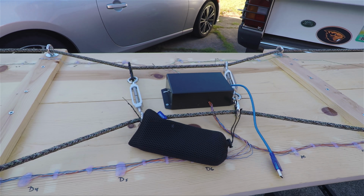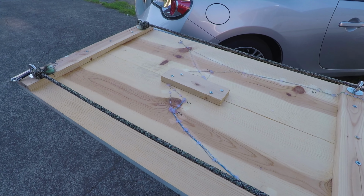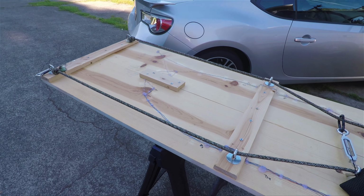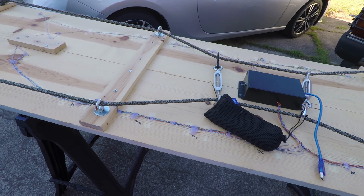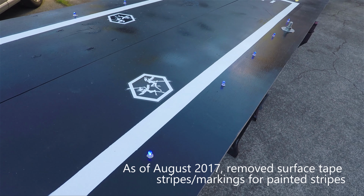The LEDs are all tied to an Arduino Uno microcontroller kit. I programmed all of those sequences myself while creating my own software PWM so I could use all the GPIO available on the board to control all the LEDs.